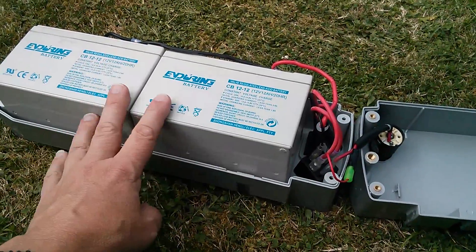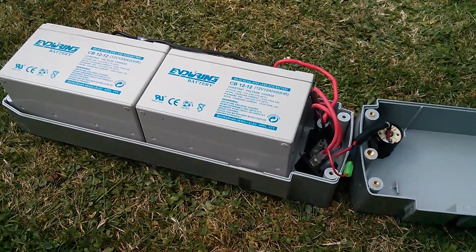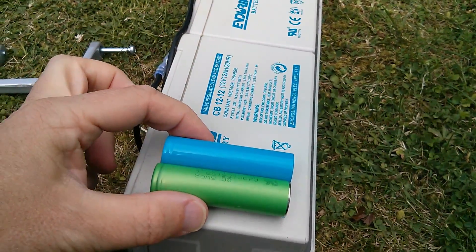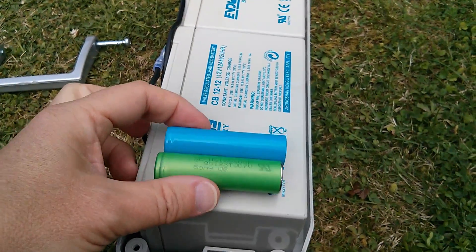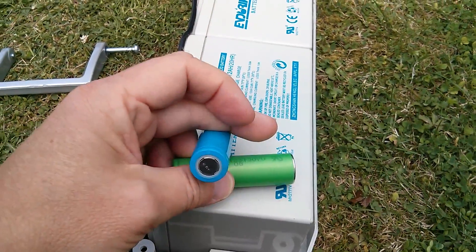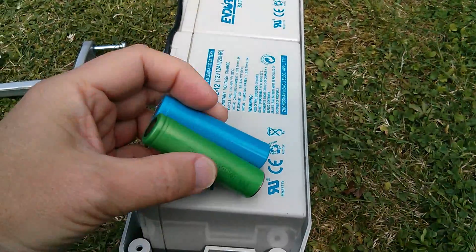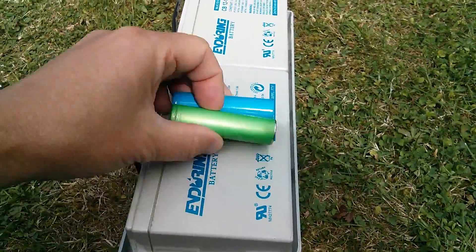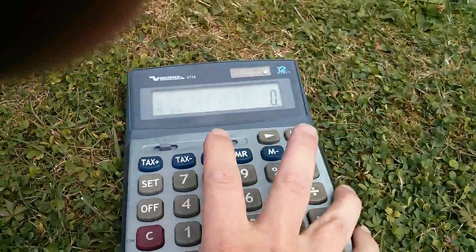I could just replace these two lead-acid batteries, but that seems a bit daft. I'm thinking: why not fill this thing with lithium cells? In terms of size, lithium cells would certainly fit. I'd need to get hold of a large quantity of tabbed cells — unless I develop my own spot-welding technique, which I don't fancy. I'd bundle them together in parallel groups, and I've calculated that seven cells in series would do the job.